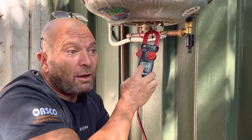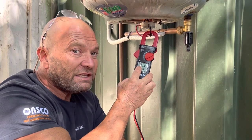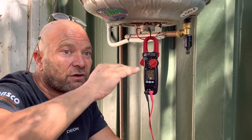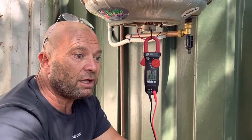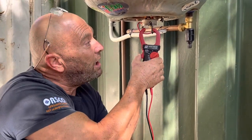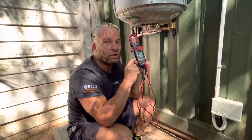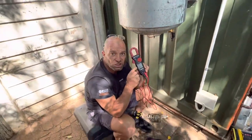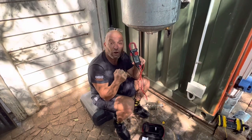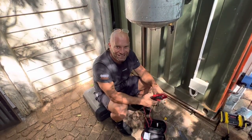Just two hours ago I was measuring 230 volts here, so this is not a pure sine wave — it varies. But I thought that would be a very cool little introduction, and I would send all my teams out with one of these. I wouldn't let them service a hot water cylinder without checking that it's actually drawing the correct amps — the flow rate. Next video we will do on utility location. Thank you.